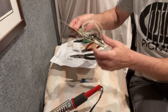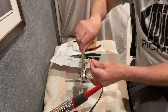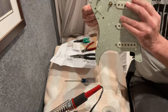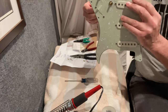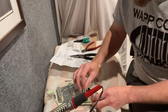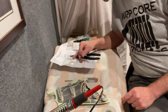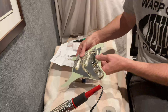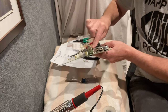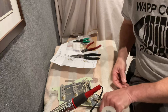I do periodically check to make sure everything's nice and smooth and working properly. These lugs are all being used, and they'll now go to our tone pots to send the signal from the pickup to the pot so it can do your tone control. Looking at my diagram — it's saying we want a jumper between these two lugs, which will go to one pot, and then this lug will go to another pot to run our tone controls.